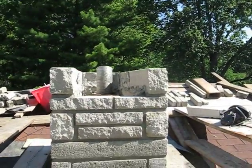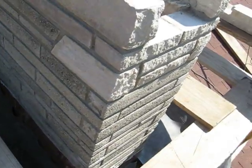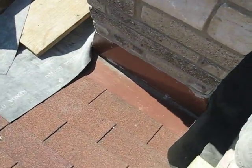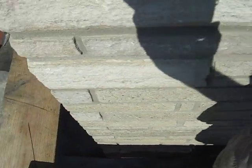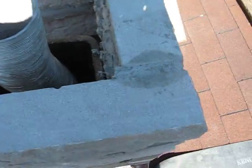We're in Upper Arlington today, getting ready to put some more stone on this chimney. Basically, it's going to get a couple more courses. Totally rebuilt this chimney like most of them, all the way down to the flashing. A lot of times I tear these down below the flashing, tear all the shingles out, re-roof it, and do all new metal work and glue it in with expansion joint concrete material, which does a real nice job making sure you don't get any leaks in the future.